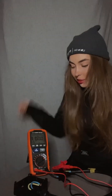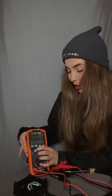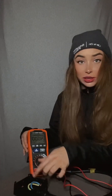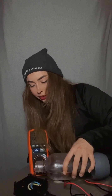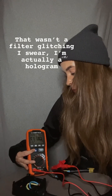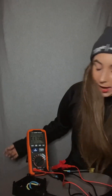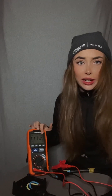Shall we fill this up with water to actually give it a real demo? I've taken the wagos off so the cables are just sitting there as they would in a box — 4,000 megaohms, not touching. Now let's put a bit of water in it. Straight away: 0.017 megaohms. And that would probably be enough for the MCB to trip, because like I said it has to be over 1, but ideally over a few hundred.